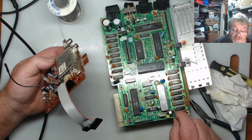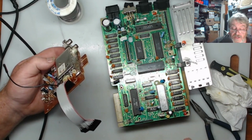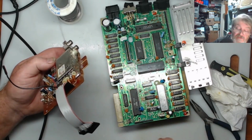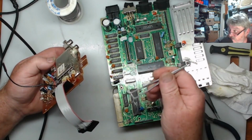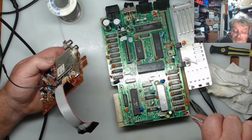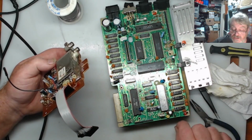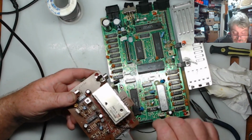So then what I did is turned around and pushed it back so it was about the right height, and soldered it, and then just slipped the plastic piece back on it. It was a bit of fiddling around, but that's where these little surgical suture pliers are really good, because they'll lock on, hold on, then you can wiggle it around and get it on. And then once I started it, I just put it over the very top so there's enough room to get around the pin, and just slide it back down. So that's all good to go, and that's what that'll plug into now for the earth.